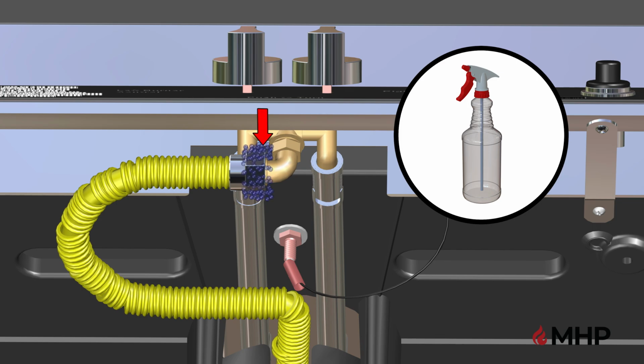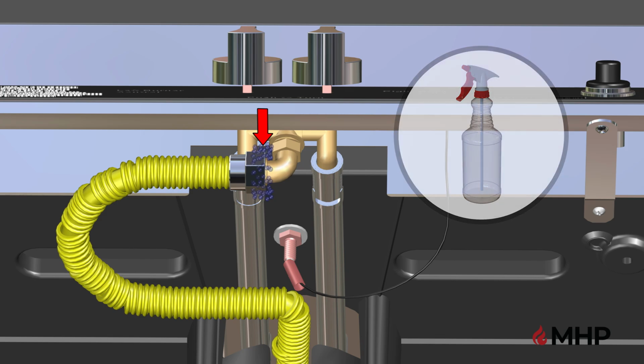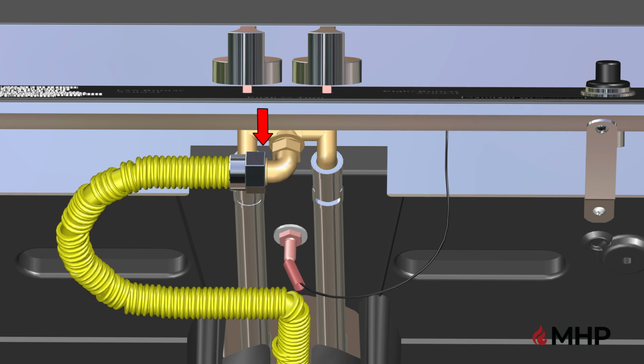Soap bubbles will appear if there is a leak. Make sure to tighten the connection to make a proper seal. If leaks are detected, retighten the connections as previously shown, and retest for leaks. If you have detected a leak, try tightening and securing all connections. The use of 2 wrenches is recommended. One wrench is used to hold the fitting, while the other is used to tighten.